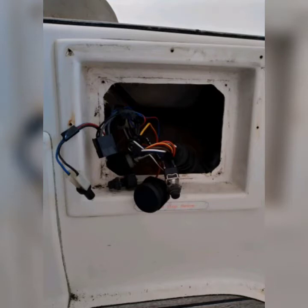Once we had removed the original Volvo Penta round plug and the head of the system that fed into the original panel, we were able to continuity test all of the 16 wires in the Volvo Penta loom. Do not skip on this process. Continuity test the loom before you start to use it.